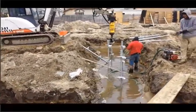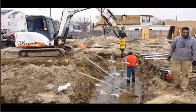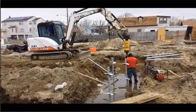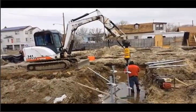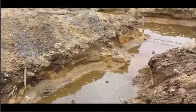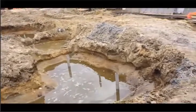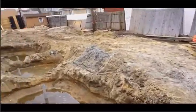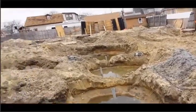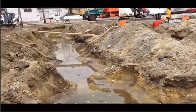As you can see, we are going with square shafts — square lead shafts — and then with a special bracket going into a round shaft. One single story house is going up here. In about a few weeks, we're going to get a grade beam here: three feet by 18 inches thick grade beam over these pile caps.